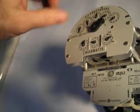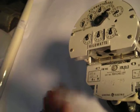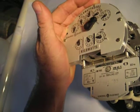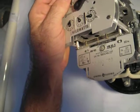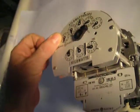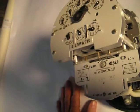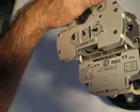A meter reader physically comes by and through the glass resets the meter. So the next month, if you don't use your air conditioner in wintertime, maybe you only go up to 8 kilowatts max. The billing on a three-phase meter is often based on what they call a demand meter — it's on some single-phase services too, but mostly on three-phase. It looks at your total power used for the month in kilowatt hours, plus they charge you if you use too much kilowatts at one time.